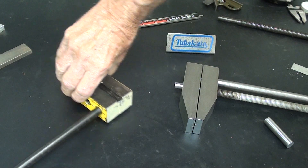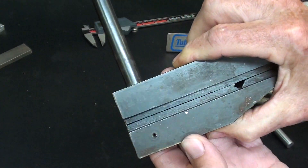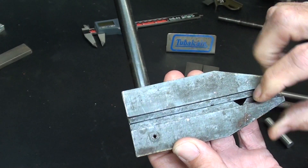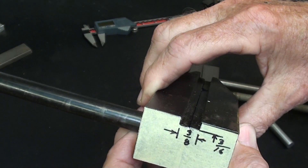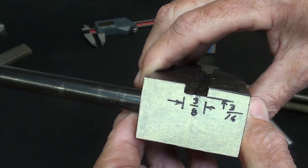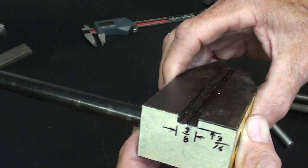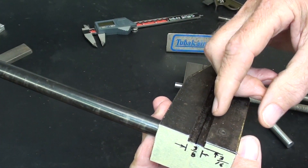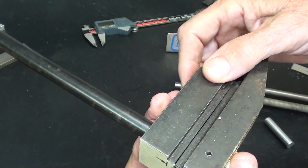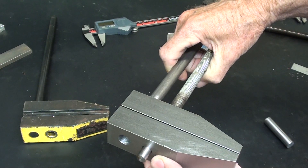Next, I'm going to put these steps in — or I should say mill the steps in — and this V-groove to hold round stock. The dimensions on that slot are three-eighths wide, so I will use a three-eighths end mill, and it's three-sixteenths deep, all the way across. I would like it to be perfectly centered on the two pieces. There it is.